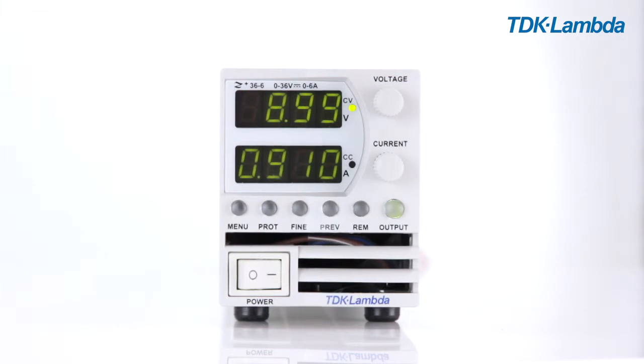In fold CC mode, the power supply will shut down when it changes from constant voltage mode to constant current mode as the load increases above the current level set. You can also program a delay time before the trip operates.